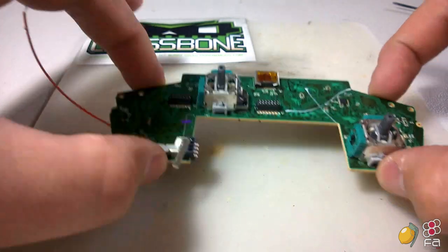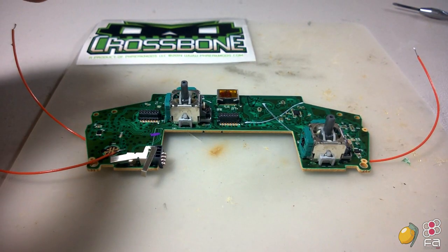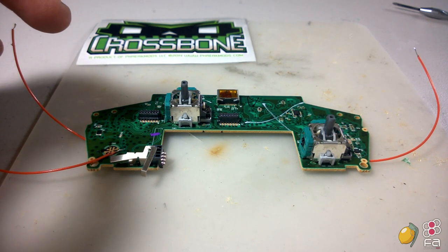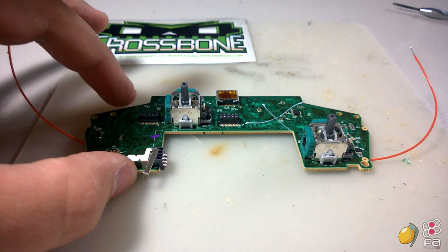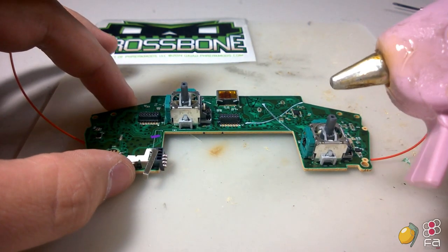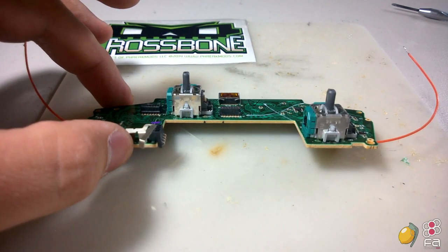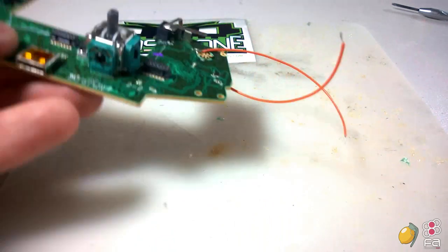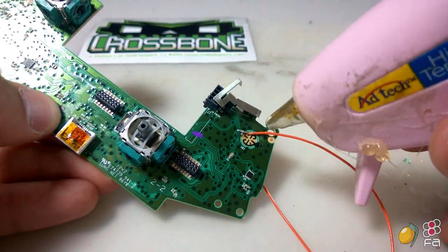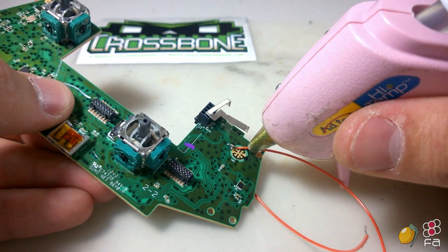This has been put together. Now, I didn't mention it before, but you're going to need a glue gun as well. I put a list of things that you need in the description. You're also going to need a glue gun, because we're going to create a little tension relief on these wires. So we're going to hot glue right before the solder points, right here or so. And then I'll show you the other two on the other places.